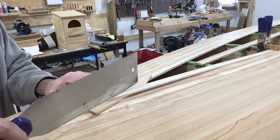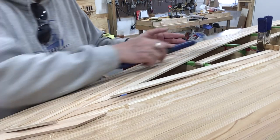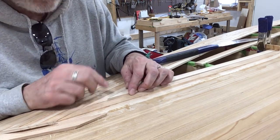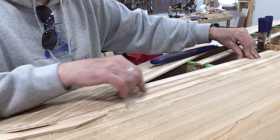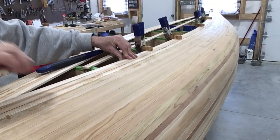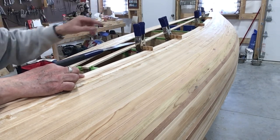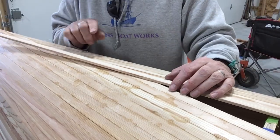Let's see how we did — it's a little bit long, but I did that on purpose. I'm going to plane off this end and we'll get that to fit right in there. The other thing you want to do is make sure that your strip is clamped down with these cleats, because I've got to go cut the other end. You want to make sure it's pretty much right on where it's going to be going so that you don't cut it off short at the other end.